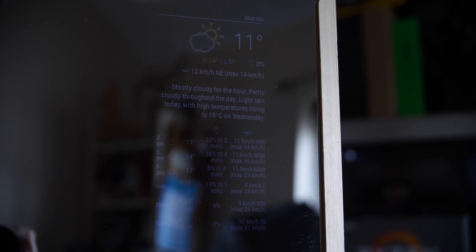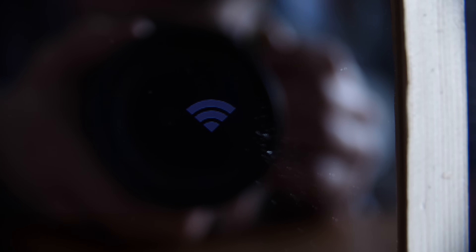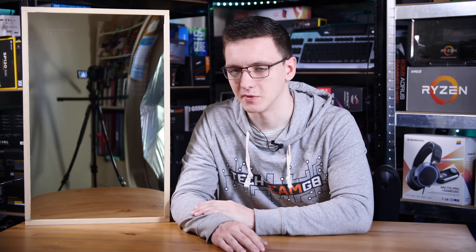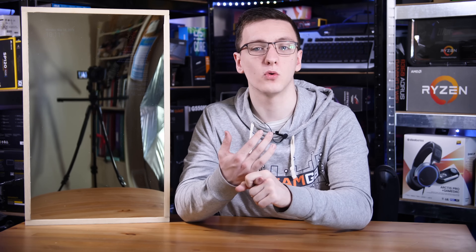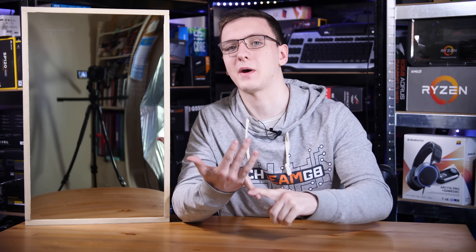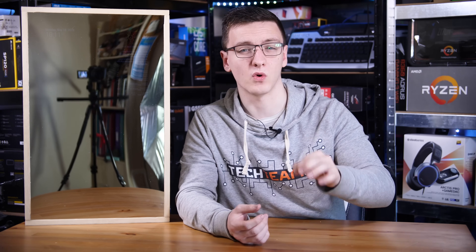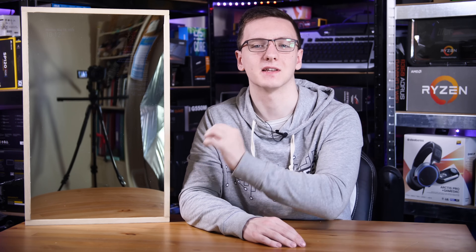The modules I have installed are the default clock as well as weather from Dark Sky. I also have a Wi-Fi internet connectivity meter, which is helpful because my internet drops out sometimes and it's nice to know whether it's my network switches having a fit or if the internet is actually down. I've also got now-playing on Spotify, system information, and a remote control so I can go on my phone to the Pi's IP address and control the monitor's power. I also have a scheduler so it turns off the display at 1am, back on at 8am, and refreshes the UI every Sunday to keep things fresh.